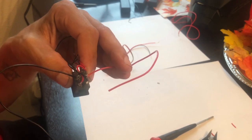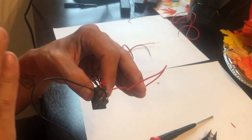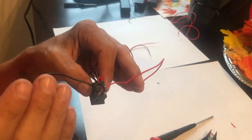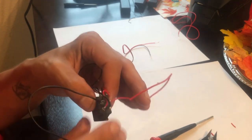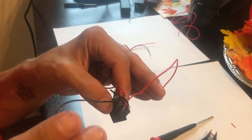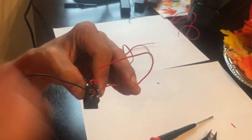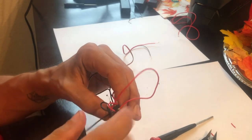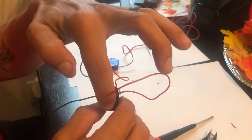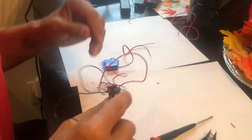This is essentially the easiest way to do it with a switch. Normally with just a regular two-way switch you have on and off — you would need multiple switches to do that and it would get really complicated. You'd have to make sure one switch is off before you turn the other one on, because if one switch was left on and you were throwing negative, you're going to arc the motor or the circuit. With this switch there's no way — once you flip it, boom, it sends the negative signal; flip it the other way, it's sending positive signal. This is really the easiest way.